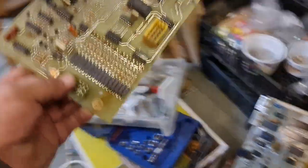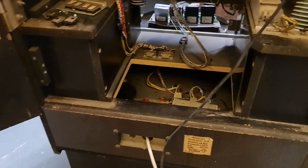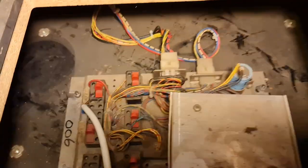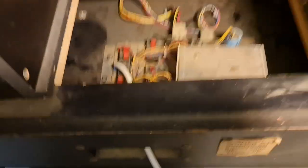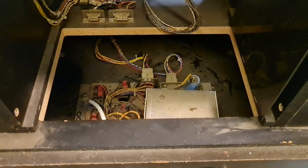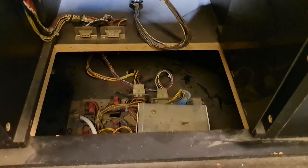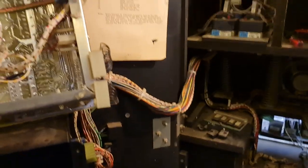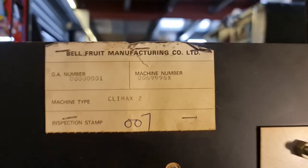I just thought I'd show you a few bits of what I've been doing — I've spent a good few hours on this. The first thing I had to do was put a new lead on it, because when they got it down the stairs they broke the plug, and the lead was short anyway. I took the power supply out, checked all the fuses, and one was blown — so that was a worthwhile exercise. The power supply's back in and I'm getting all the LEDs on the board, although there's a data collection board in there and it's not working.